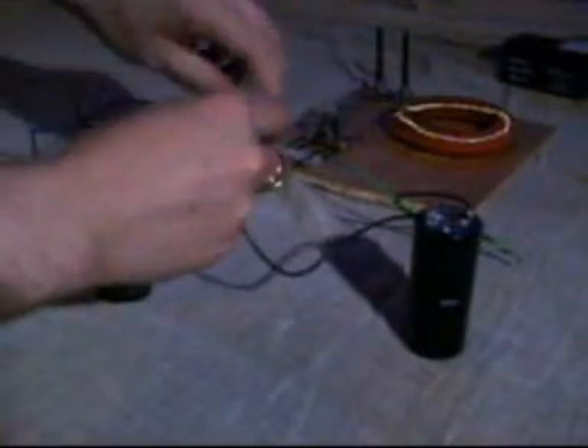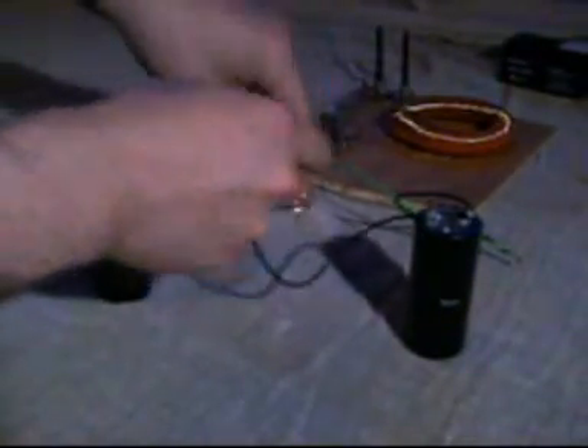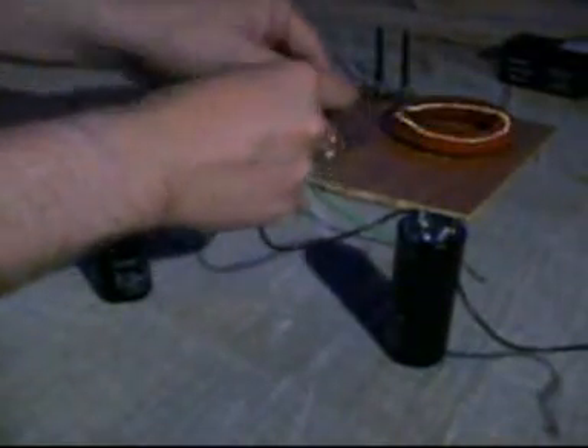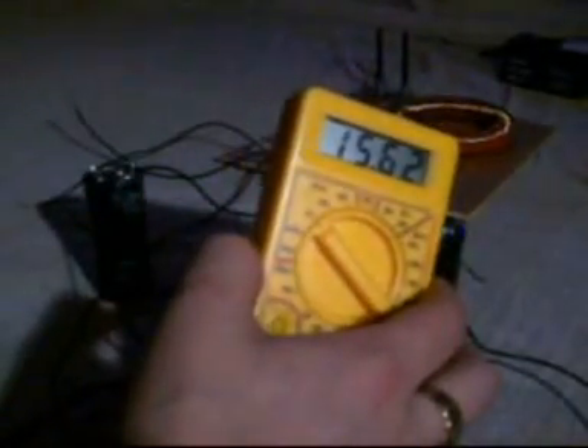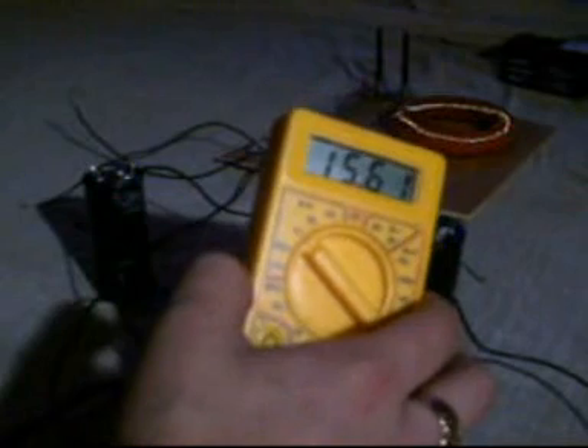Which is pretty groovy. So just to show — 15 volts of potential from 12 volts of potential. We disconnect both the capacitors and wire them in series. We connect that to that, and that to the other end of the two capacitors wired in series. And there you go — we've now got 15.6261 volts.